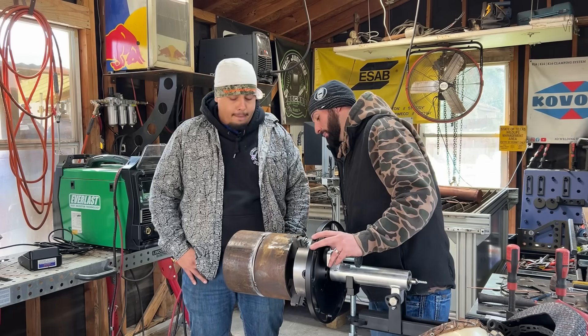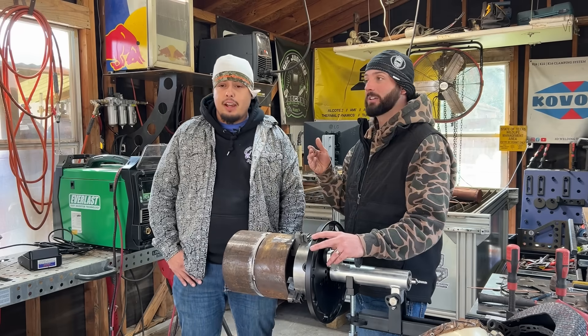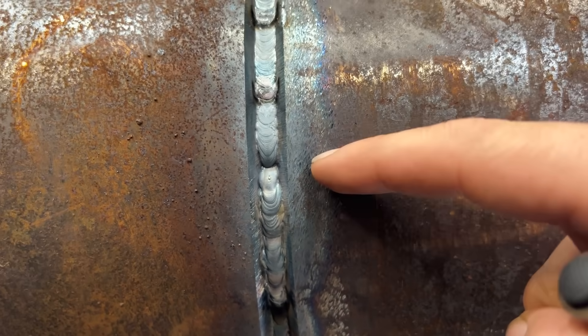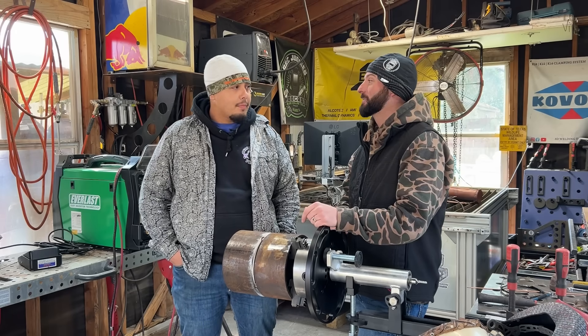Welding in position always poses some challenges, especially as you start to tie into your tacks. You miss a tie-in, you could have a pretty weld, but if you miss that tie-in — bam, it's a bust. Lack of fusion will bust that x-ray right away. What you wanted to know, Christian, is that fisheye. As you pull out of your root pass, that puddle is going to start to solidify and it doesn't finish all the way because you stop too quickly with that scratch start TIG process. You have to either tail out of your root to the bevels or try different techniques so you can see that puddle solidify before you jump out. If you don't, that fisheye will stay there, and if you weld over it you could have a void in your root. Have you ever welded on your hot pass and had that fisheye just spit your weld back out at you? They'll get you on x-ray too. I actually like the spit — that tells me I got that thing.